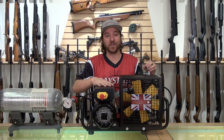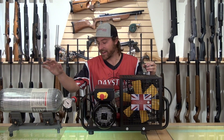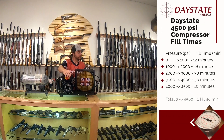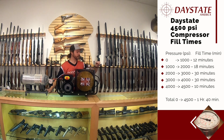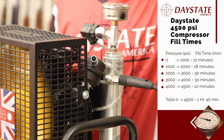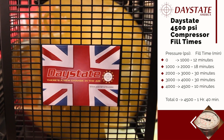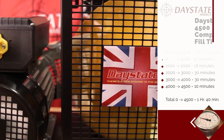This unit will fill tanks whenever you need it to — it's great for at-home use, using it with a couple of buddies. When filling the 75 cubic foot tank from empty, the entire process takes about an hour and 40 minutes on the nose. From zero to 1,000 PSI was right at 12 minutes; from 1,000 to 2,000 was just shy of 30 minutes; 2,000 to 3,000 took just shy of an hour at 56 minutes; and from 3,000 to 4,000, you're at an hour and a half, then 10 more minutes to top off from 4,000 to 4,500. Top-off times can be expected in the 30 to 45 minute range.